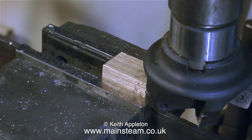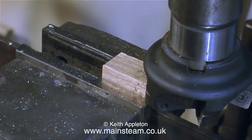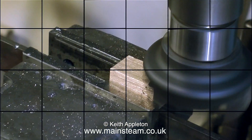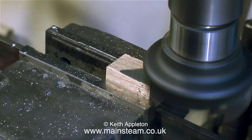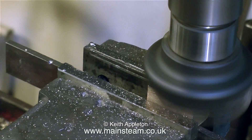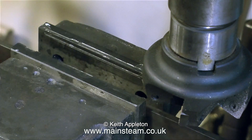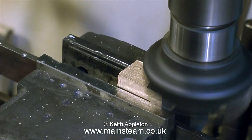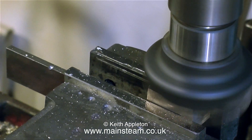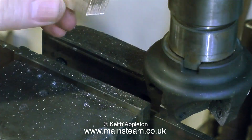By using a suitable piece of packing that I also know is level I can remove some metal from the other side and we end up with two surfaces that are fully parallel. This clip shows me tapping the piece of gunmetal with a soft faced hammer, just to make sure that the piece is held properly in the machine vise. You can tell by the sound but it does take a bit of practice. As a general rule, if you're taking a deep cut traverse slowly; if you're taking a shallow cut you can traverse a little quicker. This video is speeded up because the process is very slow.